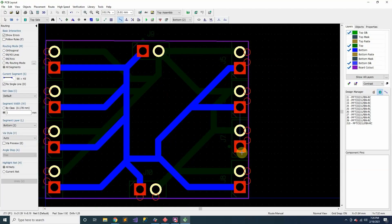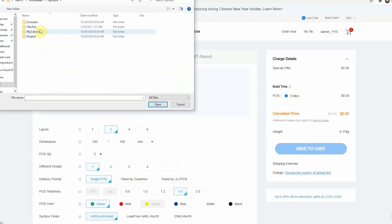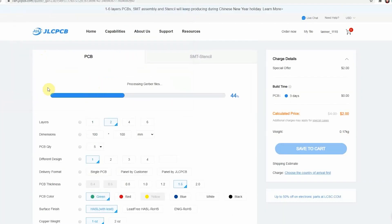What is an Arduino board? Well, it's a microcontroller development board — open source hardware and open source software. It's not just one board, it's a whole line of boards and products. Because it's open source, you can download the design files off their website, make changes and modifications, send that circuit board off to JLCPCB, and get your new Arduino-based board ready to go. I think if I was trying to learn electronics today, this is where I'd start, because it just puts everything together.